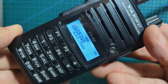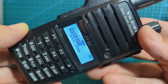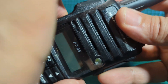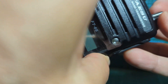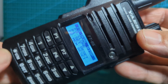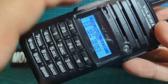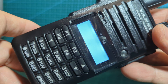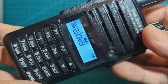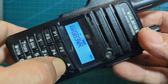How do we get back into single mode? You just do the reverse - turn it off, hold down those two buttons again, which is quite fiddly, turn it on, hold it in for a bit and let go. You go back to the clone menu, select menu number eight, press the function button, it reboots, and when it comes back you're in single mode. I think I prefer dual mode, but the nice thing about single mode is it's nice and simple.